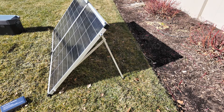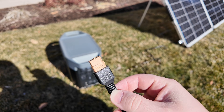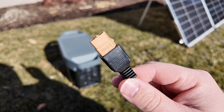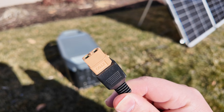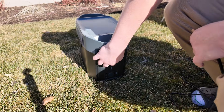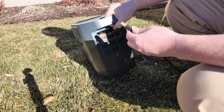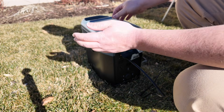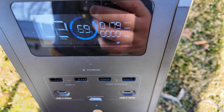Let's see what kind of power we're getting. Connected to the solar panel is an XT60 connector — great if you have a power station that uses XT60, not so great if you want MC4. It does have adapters for that, but natively the panel does not have MC4. This power station is the EcoFlow Delta 2, which likes the XT60i connector for high-powered solar input, so this may be throttled by using a normal XT60.